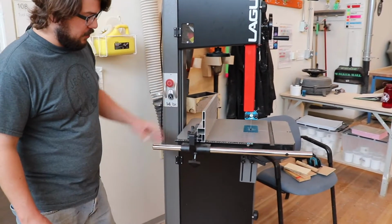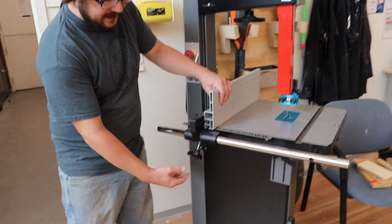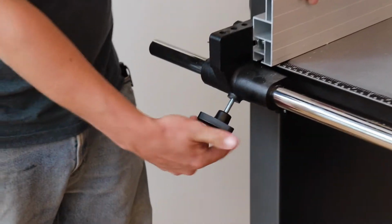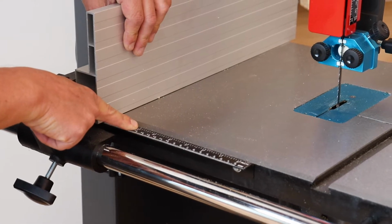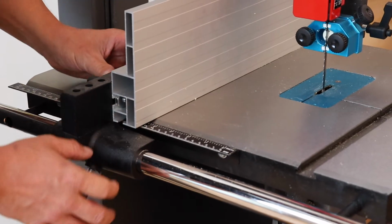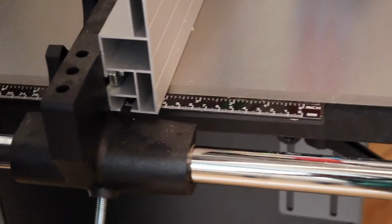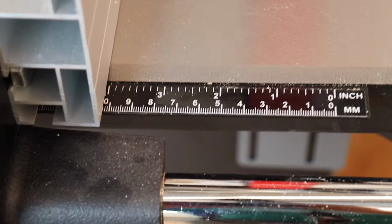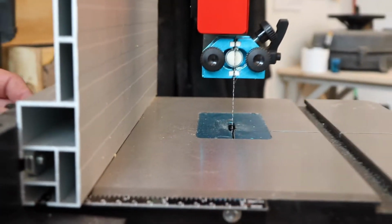Talking a little bit more about the anatomy of the saw, this is called the fence. The fence locks and unlocks by turning this hand screw. The fence is set up in line with this measurement rail on the front of the saw. We checked this one earlier, so we know it is correct, but if I were to take my tape measure and measure from the 4-inch line here to this side of the blade, be sure to double check that before you start using the tool, as tools can get out of adjustment pretty easily depending on where they're being used in the shop.